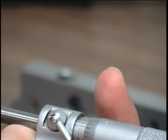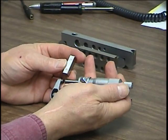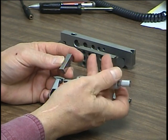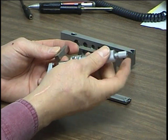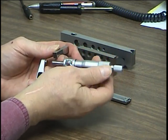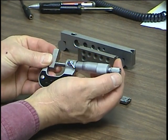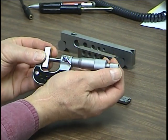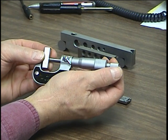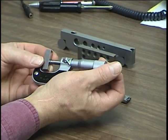To demonstrate measuring a part, here's a standard block gauge that has been precision-made and ground down to 0.350 inches. You hold the micrometer in one hand and rotate the spindle out until the anvils open enough to fit around it. At the end of the micrometer is a knob with tension built in — when that knob starts clicking, we're squeezing it tight enough to get an accurate measurement.